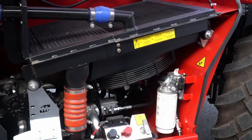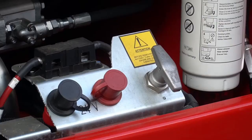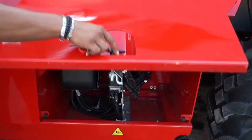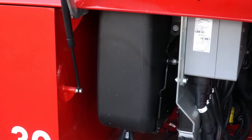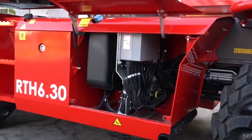Here we have a reversible fan, which you can activate from the cab to clean off any dust, debris, etc. Here is the battery on-off switch. Anytime you will not be using the machine for more than 24 hours, you should turn off the battery, as the computer will draw power at all times and drain the battery. Next, we have the service compartment, which contains the DEF Add Blue Reservoir tank and some of the machine's computers. Also located here is the chassis fuse box.